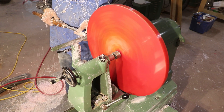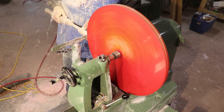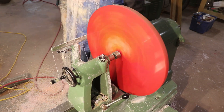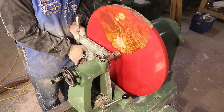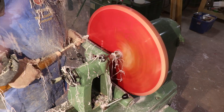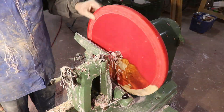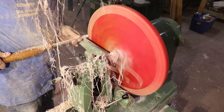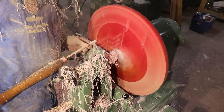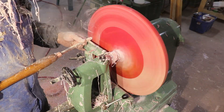This is hot glue mounted to a sacrificial block with about a five and a half or six inch diameter on the headstock side. I've got the tailstock up in place without the spur center because I don't have a lot of depth and I don't want to put a divot hole in it — it's just there for safety. The burl was actually a lot lighter than the resin, so during this entire turn I was never able to get it up over 800 RPM. Resin likes to be turned quicker than that, but this resin actually cut really nicely — I was pretty impressed with the Red Creek resin.